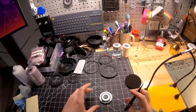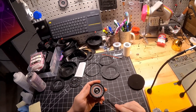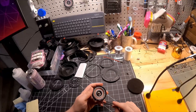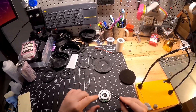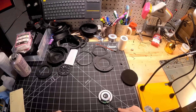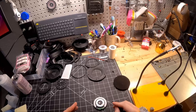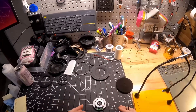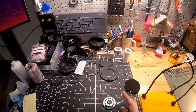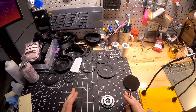The first thing we're going to do is modify the driver a little bit. It's a two-speaker driver, coaxial with a ring radiator. We're going to take that center speaker and completely remove the two wires that connect it. We're not actually going to use it as a speaker — we're disconnecting it in order to use it as a passive radiator for the internal chamber. This affects the sound drastically; it smooths out the mids, so we definitely don't want to keep that connected.